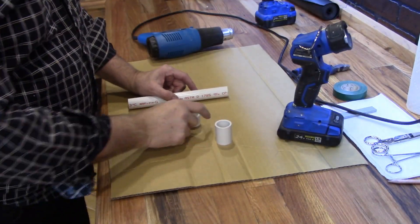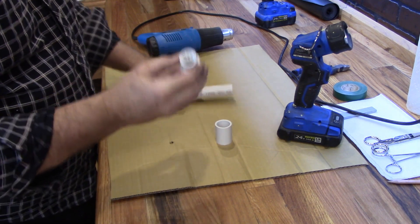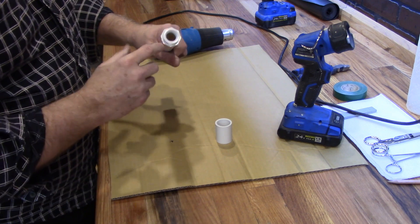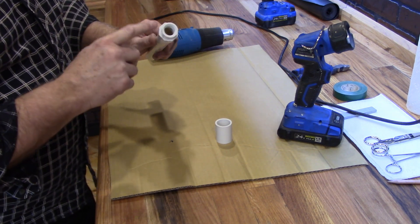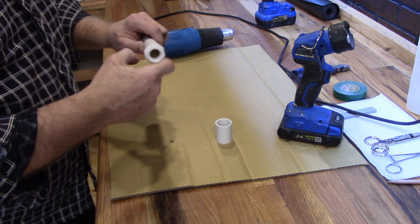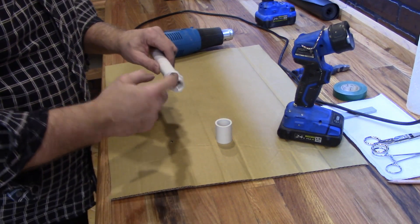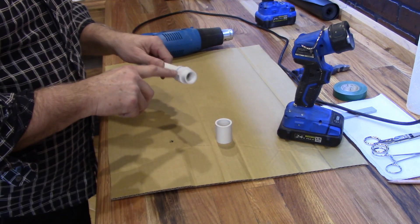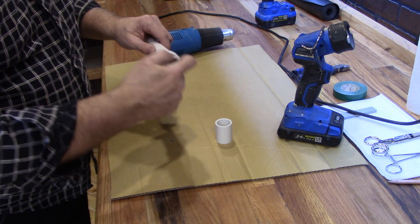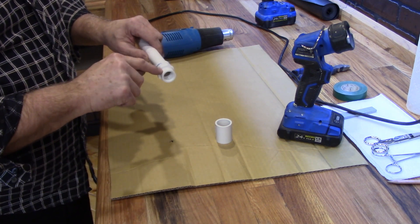Here's a quick tip: if you're going to be using a PVC threaded connector to connect to galvanized water pipe or something to that effect, if you over-tighten this it's very easy to split it. Plus, as the PVC gets older it tends to get a little more brittle — it may not split immediately, but a year or two later the stresses from over-tightening a joint like this can very easily cause it to crack.